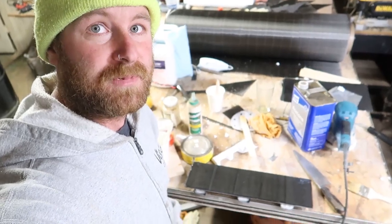So as you can see, this is a much better layup than last time. It's got all the layup layers where I'm doing kind of the overlap shingle setup. The bonding to the rings or stringers that I have is much better. The flanges are complete and there's no air gap. The Divinycell foam did a great job of smoothing everything out. So I think with this piece in mind, we're good to go.